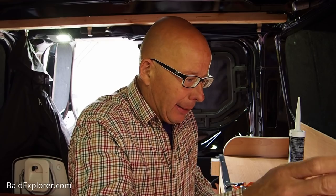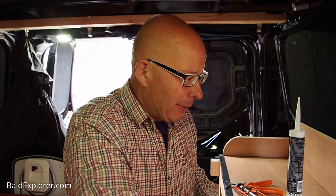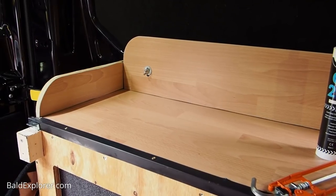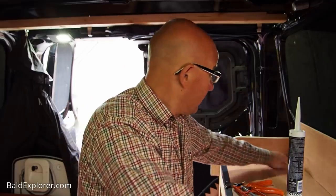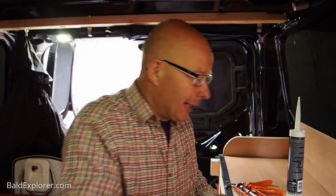In a previous episode, you would have seen Colonel Cragratti and I finish off the kitchen unit that Ricky also helped to construct with me. We put on what we now have as the splashback, effectively. But it's not quite finished, because I've been advised to put sealant around the rim, because obviously you don't want water to — if you tip over some water or something like that — you don't want water to get down the back through the cracks, because that can rot.